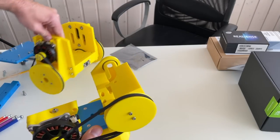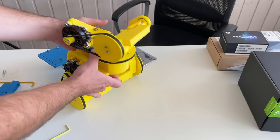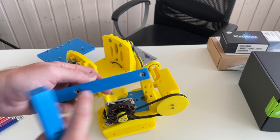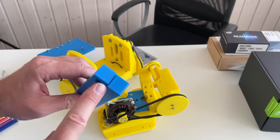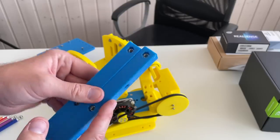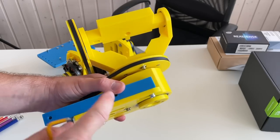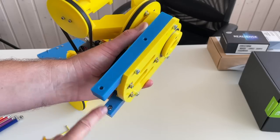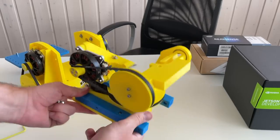This pan-tilt part should be installed in the middle of the mobile robot. For this I 3D printed these pieces which have nuts installed in them — these could be replaced by 20x20 aluminum extrusion, but I decided 3D printing them is easier than cutting extrusions. Note that this piece and this piece are mirrored, not the same, so they need to go in the correct orientation. Now we need to attach this piece to this one.